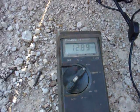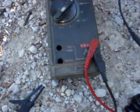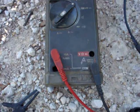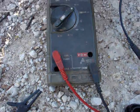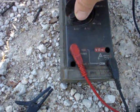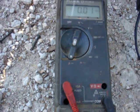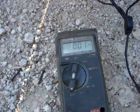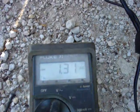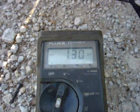I can get an amperage reading here in just a second — I'll show you how to measure your amperage. First, you disconnect from the battery and you want to go in series with your wire. Take the lead off and put it in amps. Never connect it across the battery to find out how many amps — it will blow your meter. So always, as soon as you're done with amperage, put your terminal back where it's supposed to be. We're going to go to DC amps. I've put the negative lead to the negative post of the battery, with the positive over to the negative terminal. Right now I'm looking at 1.31 amps DC going into my battery.